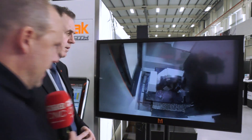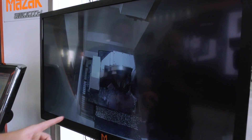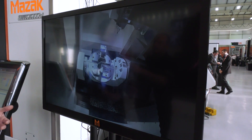We can see the bridge moving here in the X-axis and obviously the Y-axis as stated. On the bridge itself we have the X-axis and the Z-axis, which reduces the number of castings between those units to make the machine more rigid. We also employ a constant overhead Z-axis — this means that as the Z-axis lowers, we keep the bearing point from the spindle nose to the guide point the same, so we don't lose any rigidity. High performance in all situations.